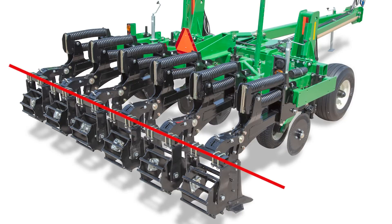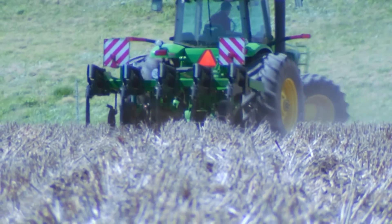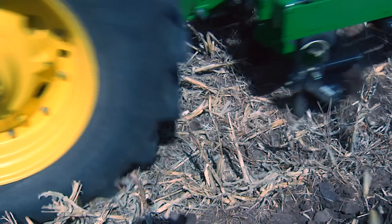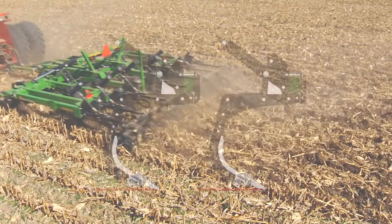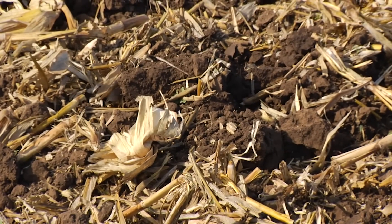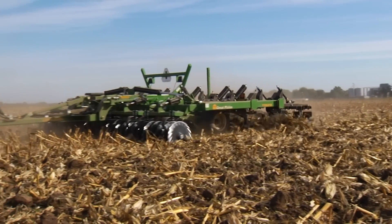The shanks must be in line. To reset the entire width of the machine, a minimum of 6 inches of horizontal fracture must occur. Some manufacturers will stagger every other row to help the subsoiler pull easier — and it does — but it comes at a price. No longer do the shanks work together to create complete horizontal fracture. When the points work alone, they will just tear a hole in the ground, creating soft and hard spots that hinder uniform emergence. Another way to get rid of density layers is with a hybrid chisel like a turbo chisel, equipped with a heavy-duty toggle trip option. This unique tool is designed to work vertically and incorporates 50 to 60% of the residue as it destroys layers. It may take a few passes to completely remove the layers, but this tool is very effective.